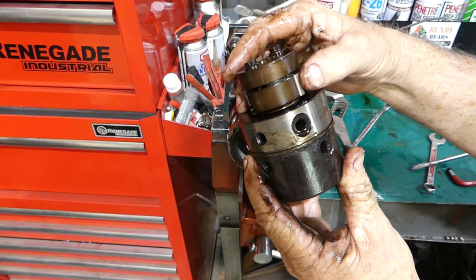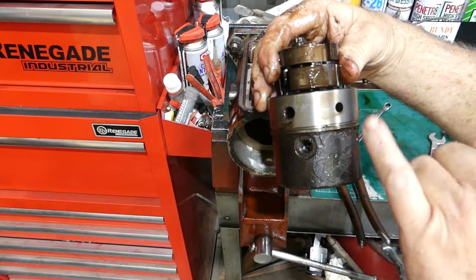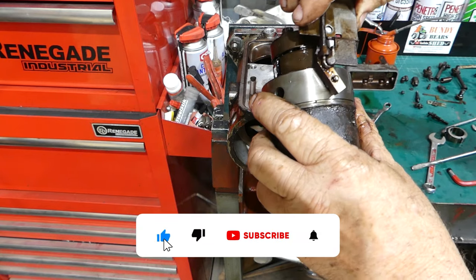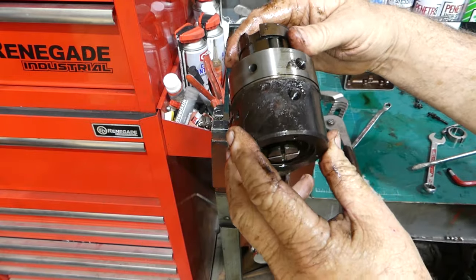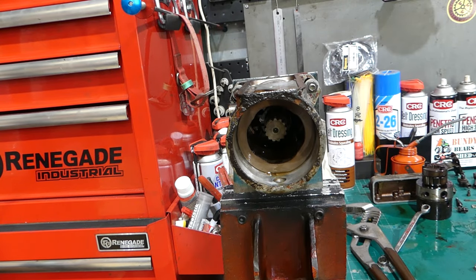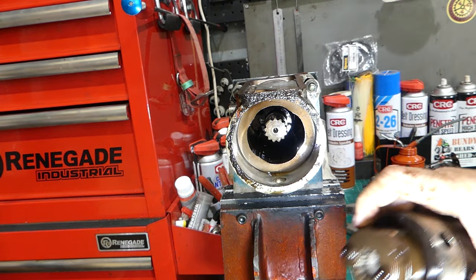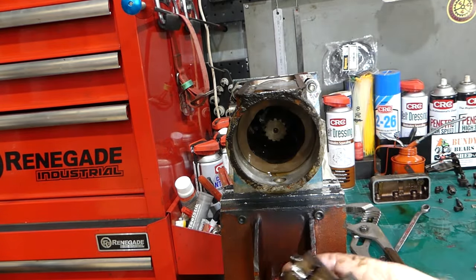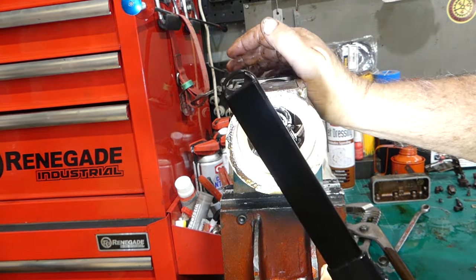There we go — that's your head. You can see some little rollers there; we'll go through this on the bench. This little hole here is where the metering valve sits — it opens to allow the amount of fuel that the pump can actually pump.